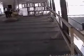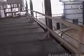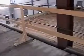The difficulty with that was we weren't able to put standard windows in as far as a 3x4 1-hour firewall. They wanted a 2-hour firewall between the upstairs and the ice rink, which really restricted our ability to put windows in. We have since re-petitioned for a re-designation of the second floor to also a public assembly, considering that we're going to have seminars and training taking place up in the business offices area, and they're rezoning this area as a public assembly as well. So we'll be able to have an ample amount of viewing areas, your typical 3x4 glass with a wire in it, looking down over the whole ice sheet, down this whole wall.